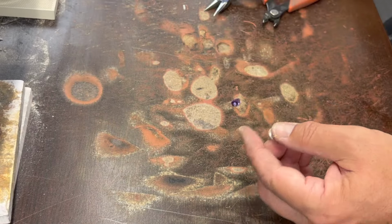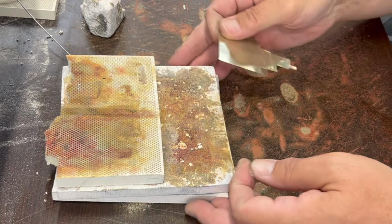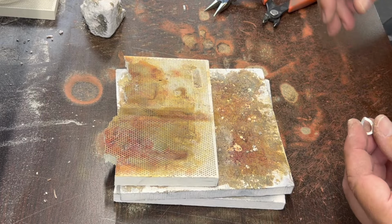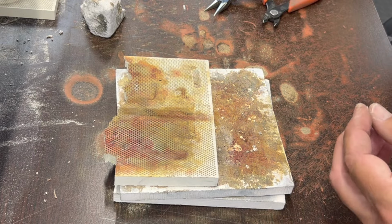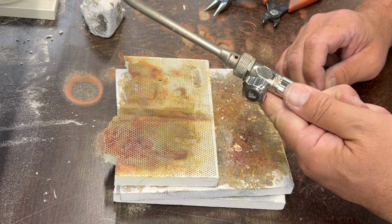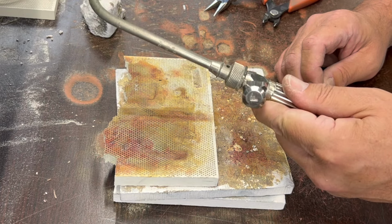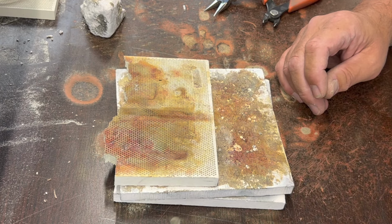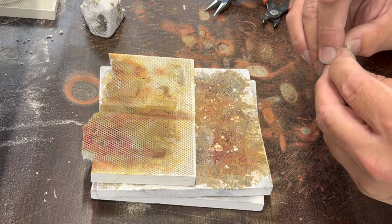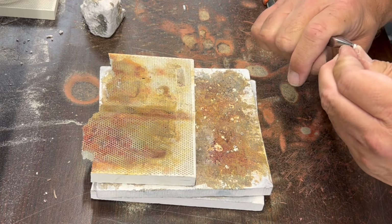If you've never been to my channel before, I use hard silver sheet solder primarily. Occasionally we use something else, but most of the time it's just this. And I use a liquid flux called My-T-Flux, and I dribble it on or spray it on depending upon my needs. My torch is a Silversmith model, which used to be called the Handy Heat torch. It's an acetylene air torch, and it's a wonderful torch. I use a number one tip on it, and that's mostly what people ask me about. So feel free to ask other questions if I did not answer any of them.